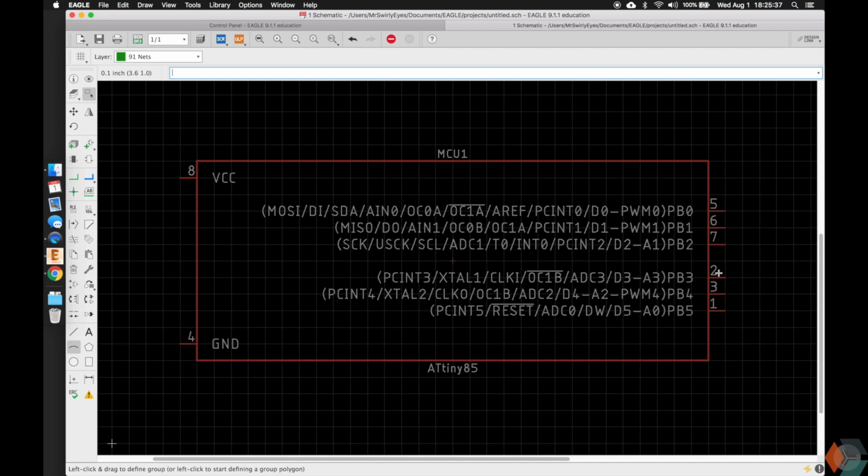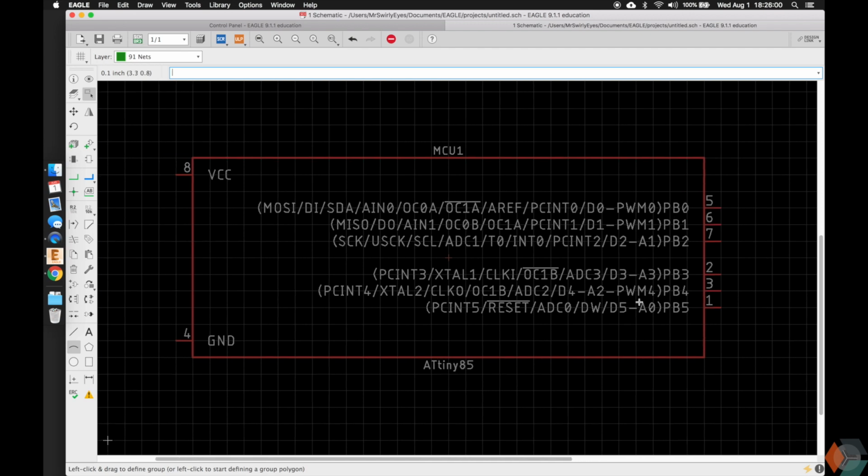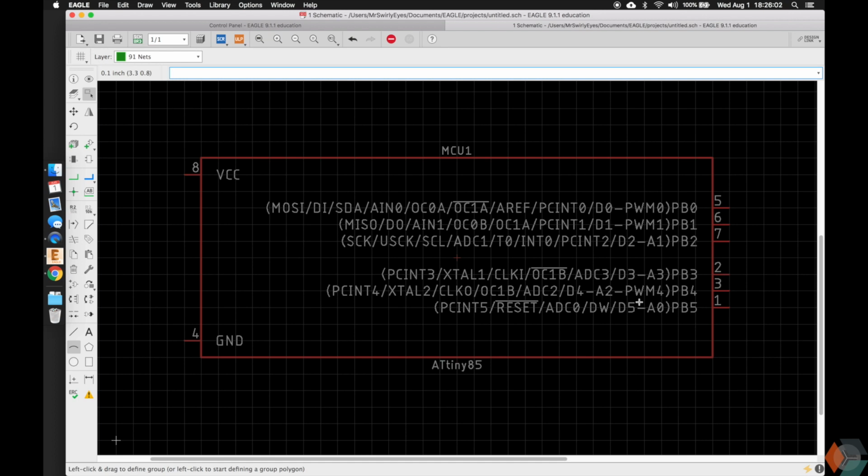And you're going to notice other pins here. These are the ones actually on the package themselves, and it follows that counterclockwise convention, but here it may not necessarily be in that order, but it is in order by its port name. This is just the convention for microcontrollers. For LEDs and other passive components, it's not this complicated, so don't worry about it if it's kind of confusing or just sounds kind of weird or meaningless.